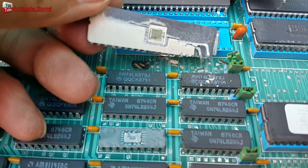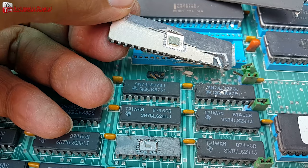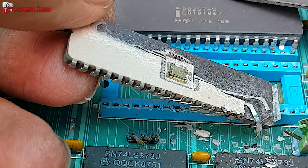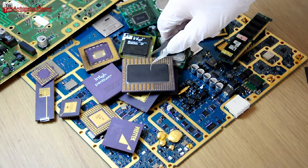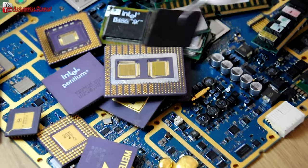The final problem is that gold is used very judiciously — only selectively plated to contact points — and the plating thickness is measured in micro inches. Five to 20 micro inches is a common thickness, so there's not much gold in most modern boards. A lot more was used in the 1960s and 70s when most electronics was industrial rather than consumer.